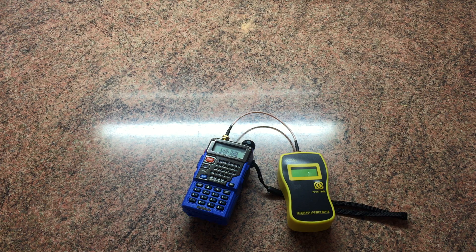The reason for that is because the quality control is so erratic on some of these radios — people wonder whether they do what they say on the tin. Most of the UV5R family of radios are advertised at 5 watts, but I've had some that measure 3 watts on high power and some that measure close to 7 or 8 watts on high power.